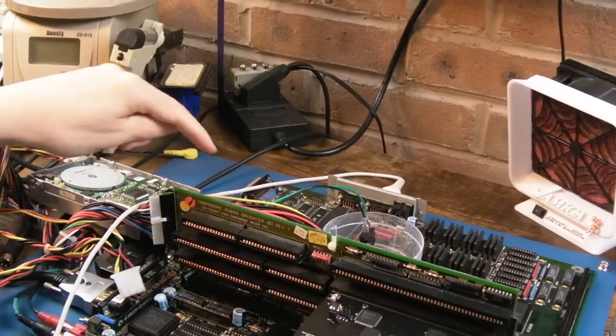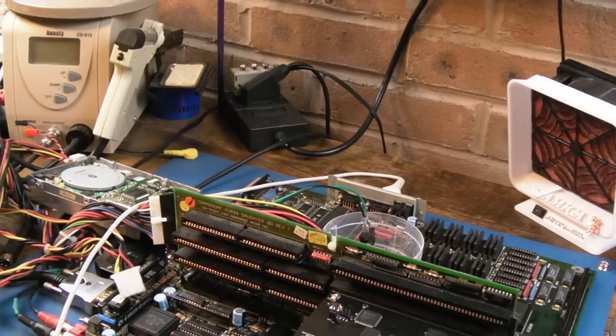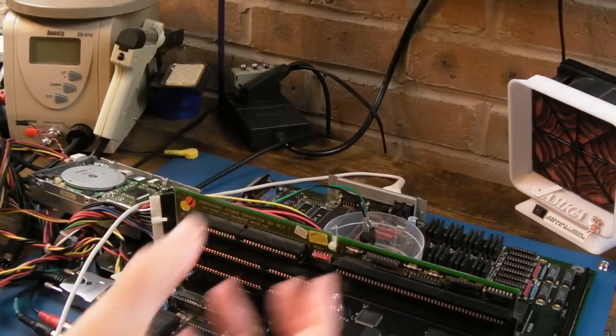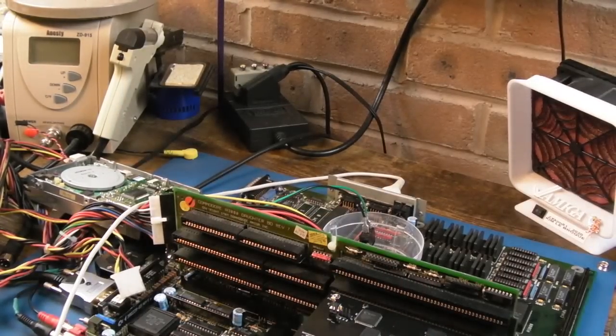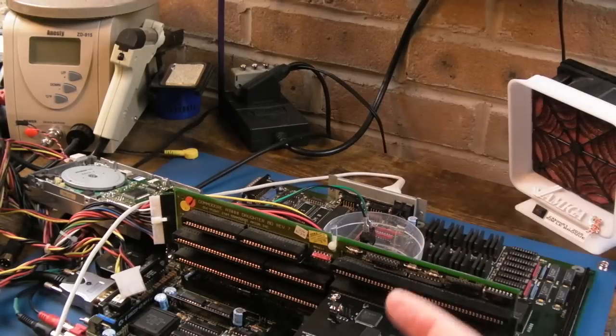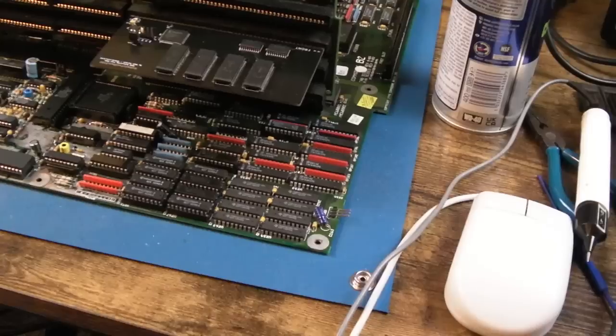Right, no mystery at all. It's a 7407. It's an open collector device. So you need a pull-up. It's not capable of pulling high. It can just pull low. It's a high voltage rated part, up to 30 volts, actually. I'm not sure if that's just on the output, but I presume it probably is. So you can have up to 30 volts, I think, and it'll pull low. Obviously current is something to think about as well, but anyway, yes, that's probably the issue.